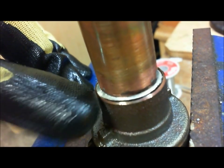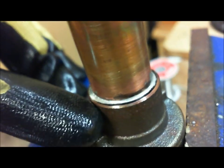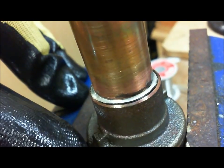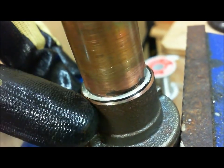This takes a lot more heat and a lot more workability because the heat transfer from the copper tubing to the bronze alloy is, well, there's a big difference there. This one takes a lot more heat than the copper tubing, so that's why when you solder, I recommend you heat up both the tube and the socket, okay?